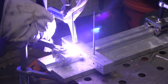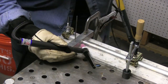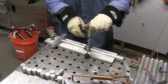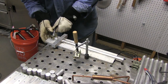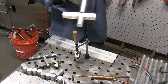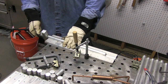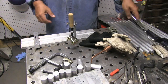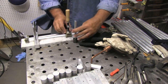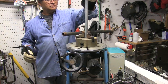Let's finish getting the tacks on this piece. I'm just putting two tacks on each side, then I'm going to put it in a positioner and just go. My little setup makes it pretty easy to run through these things and get a total of four tacks on each one. This would also not be a bad way to weld them without a positioner — you could put it in this little trough and just rotate it, welding about half at a time.